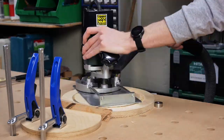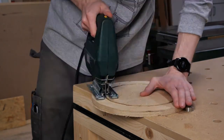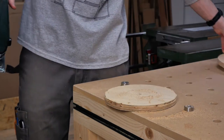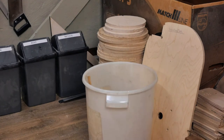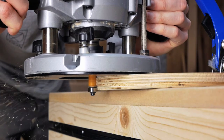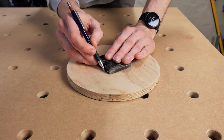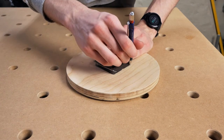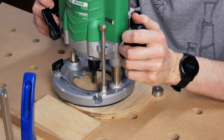After sanding the edges and removing some tear out, I'm making the birch plywood circle for the center. When routing the circle I don't go all the way through but only 5mm deep, so I can cut away the majority with a jigsaw and finish the shape with a flush trim bit. Since I'm using 15mm thick plywood the clock spindle isn't sticking out far enough, so I'm making a recess for the clock mechanism to fit in, which may also prevent the mechanism from rotating on the plywood itself.